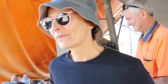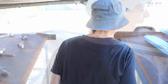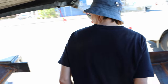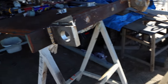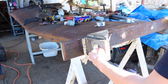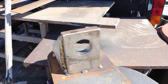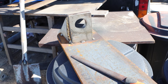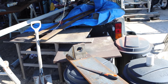The pins are what I've been working on this morning. Damien was out here too. I've been cleaning this pin up on this end here — this is the one that galled up real bad and wouldn't fit. This one I'm just about to start on — I need to use that file to basically clean up that hole. So that's the morning's progress.